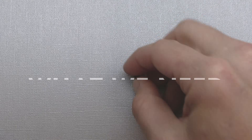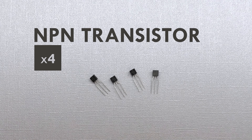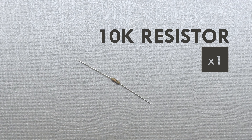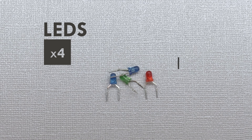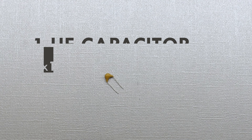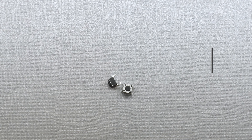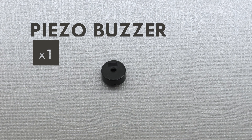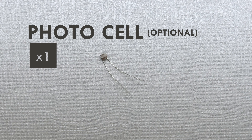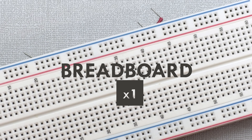The parts we're going to need are four NPN transistors. We use the 2N2222 — it's probably considered the most common and versatile transistor out there. We're going to use ten 1K resistors, one 10K resistor, and four LEDs: two blue, one green, and one red. A 22 microfarad capacitor, a 1 microfarad capacitor, two tactile buttons, a piezo buzzer, and a diode — for this project you can use just about any diode. An optional thermistor, an optional photocell, some wires, and a breadboard.